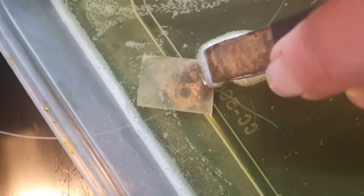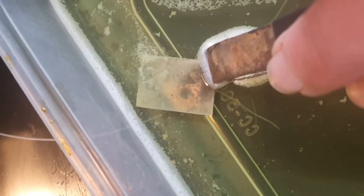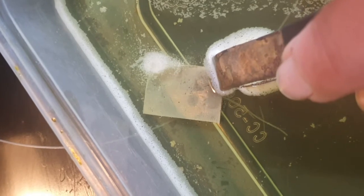We've got our first piece of board in the solution, with the negative connected to the board and the positive connected to a piece of solder which runs into the solution. Of course the negative clip is also going to end up getting plated potentially as well, so don't use your best clips.